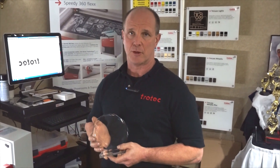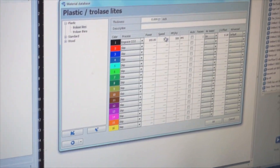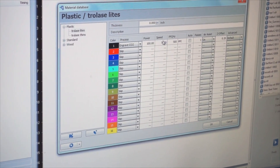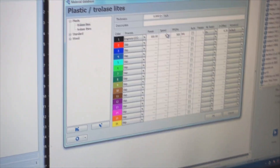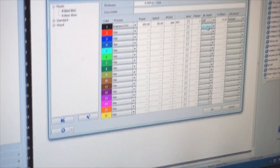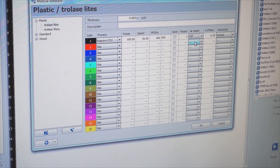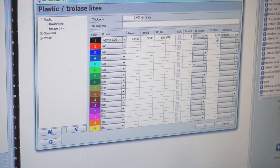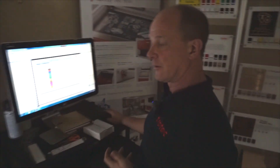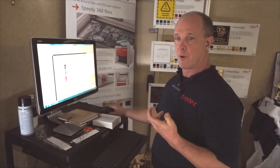On screen I've got 100 power and I'm going to run at 50 speed, giving a fairly deep engraving. I'm going to make sure my air assist is off — you never want to engrave with air assist on for the raster part; only use air when cutting. For this job I'm going to go almost a quarter inch out of focus, which allows me to get a clear image as opposed to a white frosted image.